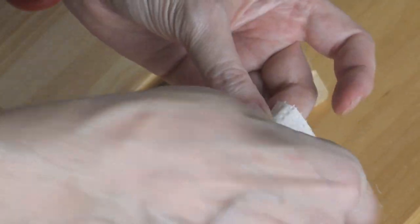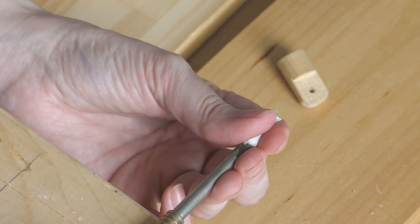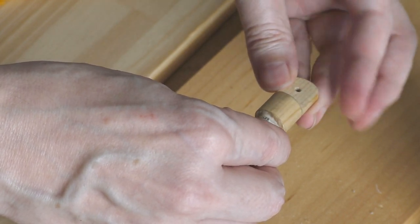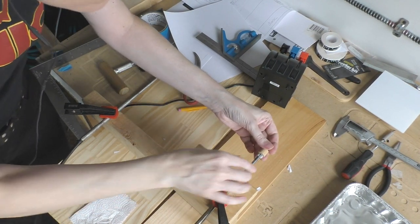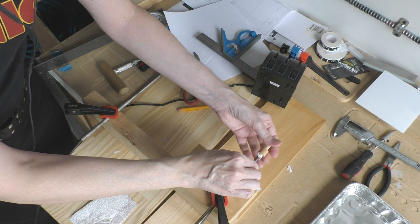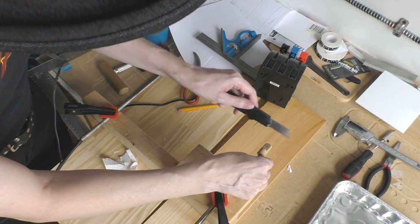Now something interesting — I wanted to thread the wood. I did this by taking a piece of paper towel and wrapping it around the threads, then saturating it with PVA glue, and forcing the glue-saturated adapter end over the paper towel. The glue would saturate into the paper towel, and every now and then I'd give it a little wiggle to make sure it wasn't sticking to the steel. I let it dry overnight on both ends, and basically the glue creates a hard thread with the paper acting as an interface medium.